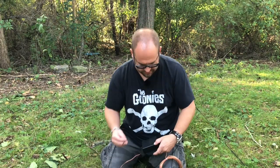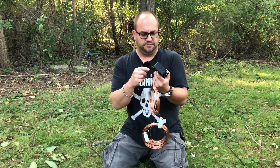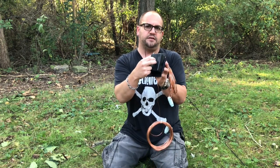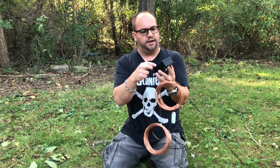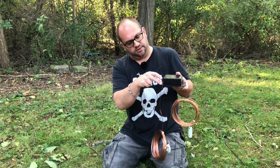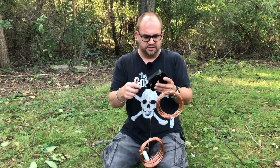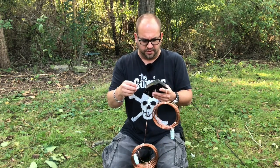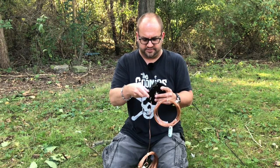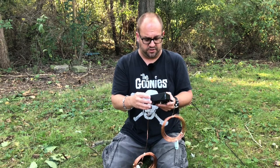This is made of a similar box to that QRP tuner I have — the back part — and they just use this plastic, so it's not sealed. I emailed Richard from MFJ and asked if this is going to be okay in the Michigan winters when it's going to be covered with ice for six months. He did suggest sealing it up, so I just sealed it with a couple of coats of liquid electrical tape.